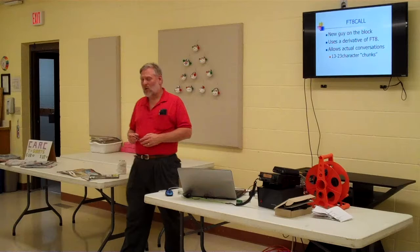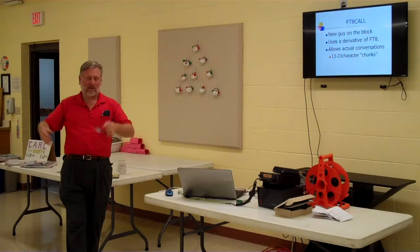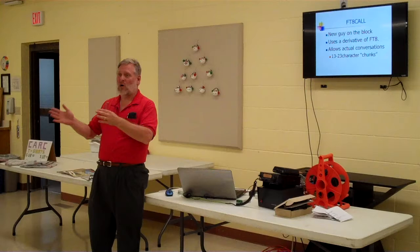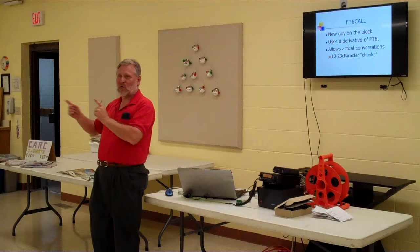So with FT8, there's a new guy on the block. People said, well, what good is just sending a signal report? I actually want to talk to somebody. I want to tell them my rig and my antenna and all that stuff. Well, one of the other guys, I can't remember his name off the top of my head, created a derivative of FT8 called FT8 call. And what FT8 call does is it allows you to send 13 to 23 characters in chunks. It'll break it up into those 15-second chunks. And you can actually say, hi, my name is John, I live in Gaylord. Boom, hit the button, and it'll chunk it up into 15-second pieces and send it to the other party.